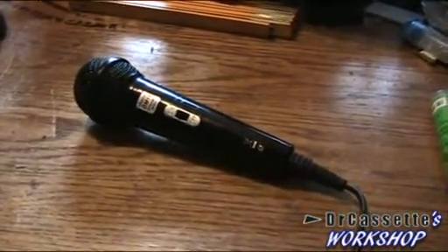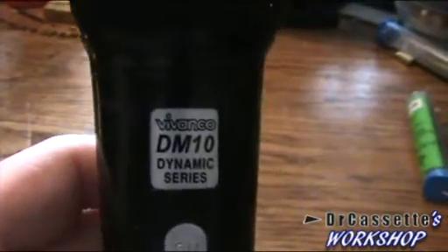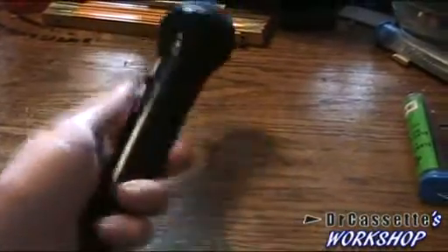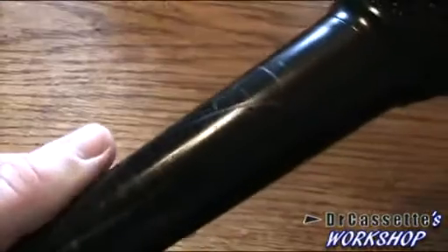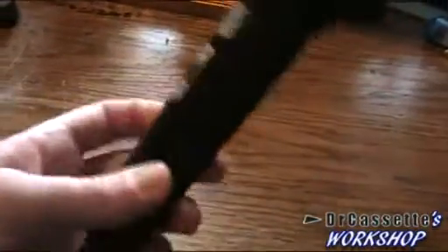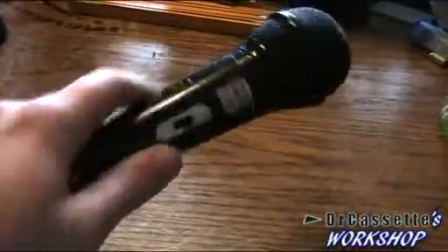What we have right here is the base for our project. This is actually the cheapest and most terrible microphone in my whole huge collection. It's a Vivanko DM10, and right after I got it I had to send it in because it was buzzing — and now it's buzzing again, so this really is a fail. Also, the body of the microphone isn't in the best condition. You can see it has all these lines around it, which is the same thing that Clydeside described in one of his videos: the cable had a chemical reaction with the body, and the cable actually melted the plastic of the microphone body because I had the cable wound around it to keep it organized.